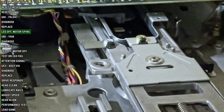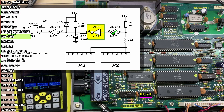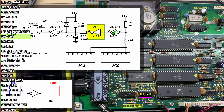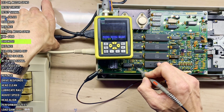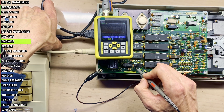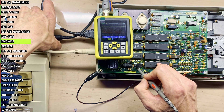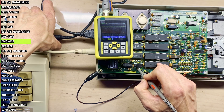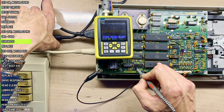The motor though is still spinning, so we aren't out of the woods yet. On to the next chip. The second chip in line on the reset circuit is called UB1 — another NOT logic gate, designation 7406. Same procedure, first merry-go-round of the pins. But there's already an issue on the first output. On pin 1 there's the signal from the previously fixed chip, which upon turning the drive on goes high and then back low, but the output always stays high. It should instead go low for a moment and then back high — the opposite of the input. So let's swap this one out as well.